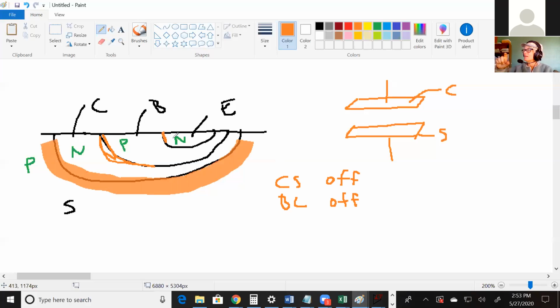So just like when we had a transistor that we're saying, hey, this looks like a big resistor. It's not actually a resistor as we know it, like a traditional resistor, but it behaves like a resistor. Same thing here. This is not actually like a parallel plate capacitor, but because it takes time to adjust to a new voltage, it's acting like capacitance.